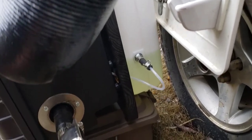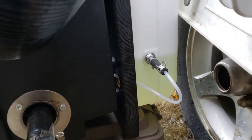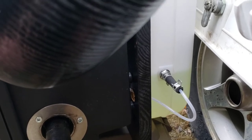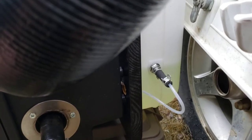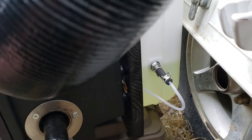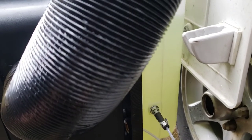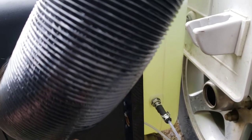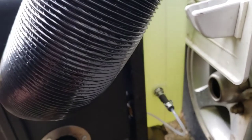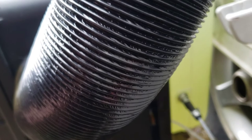I see what's going on here. Because the tank is sitting at an angle, the fuel has actually dropped below the intake — so it's out of fuel. That makes sense. I can add some more and get the experiment going again. There's something to keep in mind: there's going to be a significant amount of fuel left in the tank, but if it's below that intake level you're not going to be able to draw from it. So you're always going to want to keep this thing topped up and keep a jerry can handy.